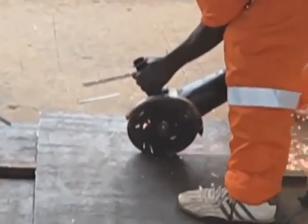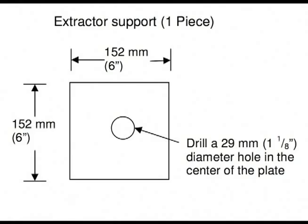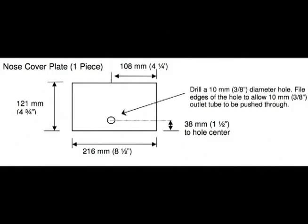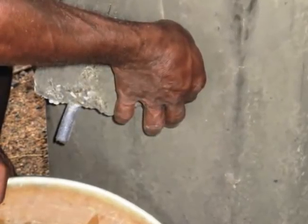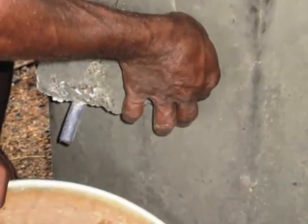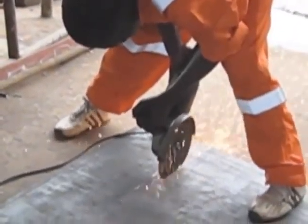Make sure that your sheet of steel is flat — it shouldn't have any concave or convex areas. Also, at least one side of the sheet should be free from rust, because rust will make concrete stick in the mold, which will make it much harder to produce a Biosand filter. Once you have cut all the pieces, drill a hole 29mm in diameter in the center of the extractor support piece. Drill a hole 10mm in diameter in the nose cover plate piece, and file the edges so that a piece of 10mm plastic tubing can fit through.